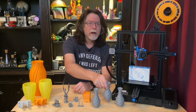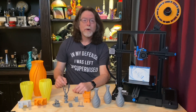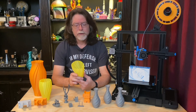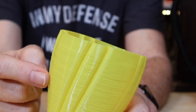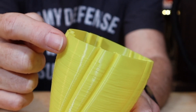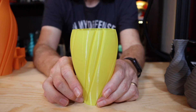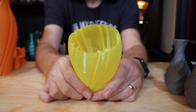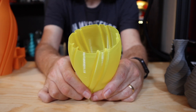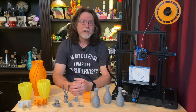Fast printing is definitely an area with a bunch of factors to take into account for good results. There may be some models that just won't print well if you print them fast, and others may work just fine. I tried to print another vase model in a flexible TPU filament, and the first time I tried, the nozzle was kind of pulling the model along with it so the layers weren't lining up. I cut the print speed in half while it was printing and it started to look good again, so I re-sliced it at a slower speed. The second time I got a much better result, but once it got to a certain height the vase was just too floppy and it started to fail again. I think if I experiment with speed and extrusion width, I may be able to get a vase printed in TPU that actually finishes.